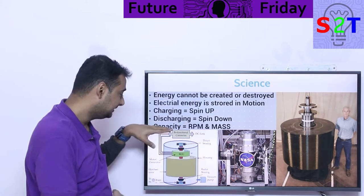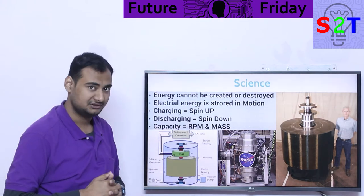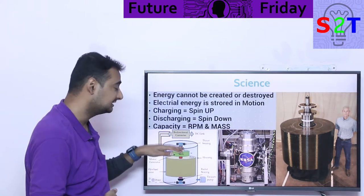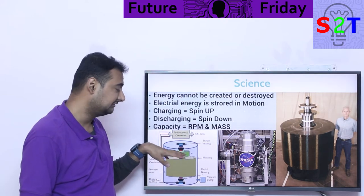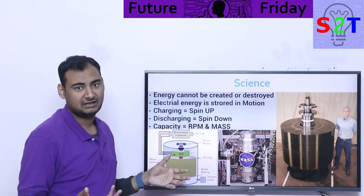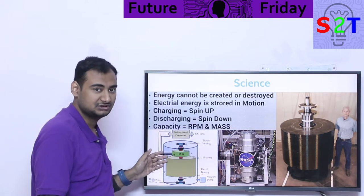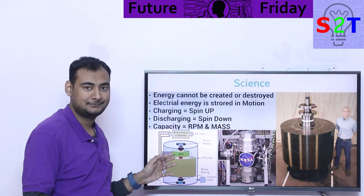It also makes it compact, and then you encase this puppy in a vacuum chamber or a helium or hydrogen filled chamber. You will generally use a helium or hydrogen filled chamber if you have something that needs thermal conduction. That will allow the heat to be distributed evenly and cool off the equipment. Now, if you do not do that, you still have to have cooling equipment in this. Depending, you could have liquid cooling or you could have heat pipes that are connecting the hot components to the chamber wall. That way it can dump the heat out, because if you do not plan for that, you may end up cooking the equipment.